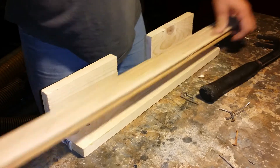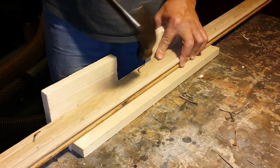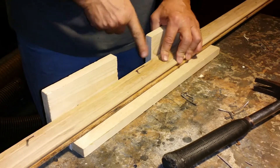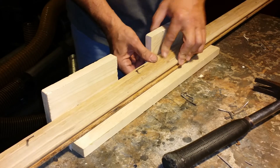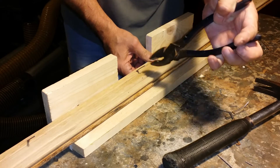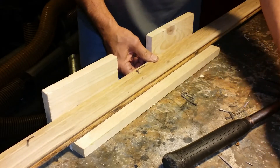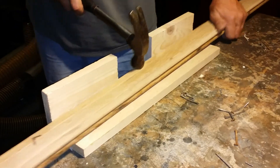Now I did want to point out you'll run into some cleats that are bent over. Some you can just straighten up and drive out. But some cleats will bend over to where you can't drive them out — what works really well is to put pliers at the end of that bend, wiggle it back and forth, break it off, and then go ahead and drive it out.